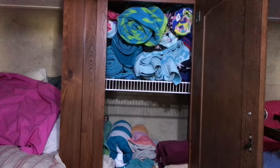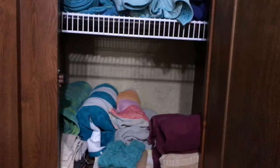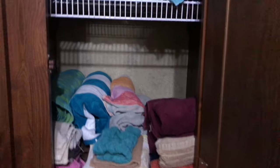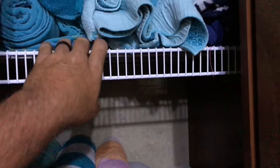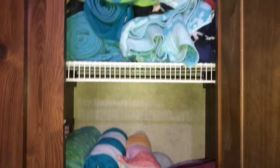Back in the bunkhouse, we have a cabinet that's a little over two feet tall. We were constantly making a mess because you couldn't separate anything — it didn't have a shelf. You'd stack it full of towels and couldn't pull one out without making a mess. So I bought wire shelving — it's coated metal shelving. I didn't use any of the standard attachments; I just cut it with a hacksaw. I cut a couple pieces of wood and used four short screws to attach it on both sides. It's not going anywhere, and now we can keep towels separated without making a mess every time.